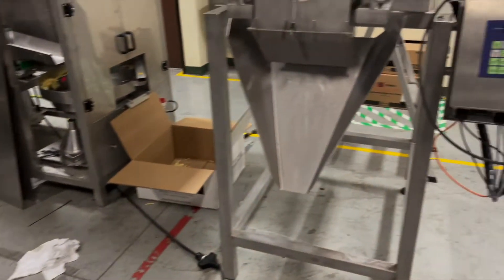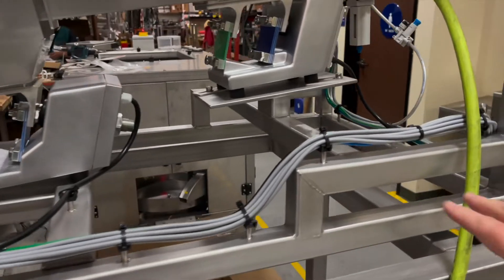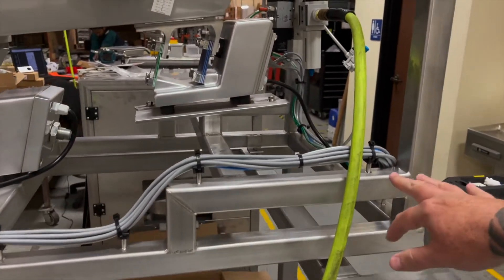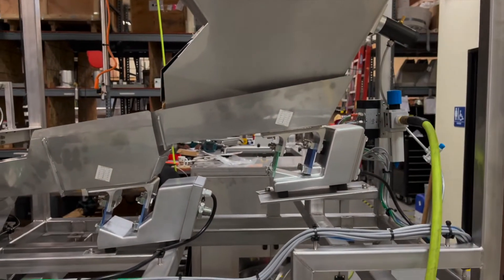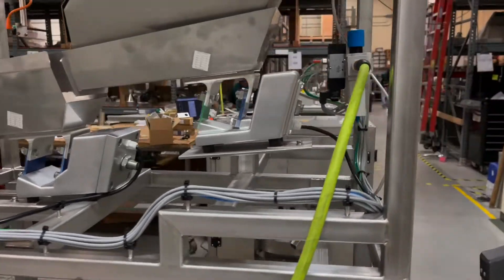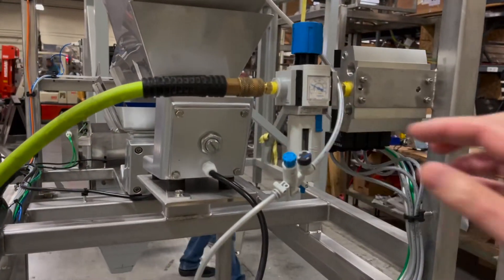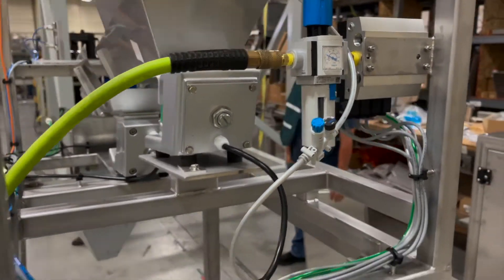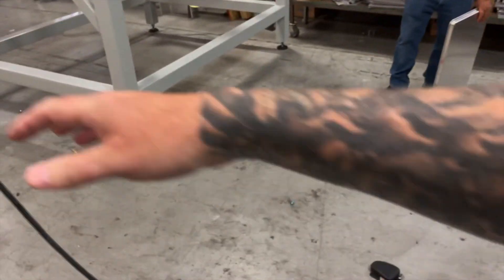You have a stainless control box and on this side you'll see all the wires — there are no holes drilled in anything, so no bacteria can get in there. These are all interior welds as well. There's an upper vibrator if you need it, and a flow control to turn it up or down depending on what you want. It's set at 40 PSI. Let's run it real quick to show you how to operate it.